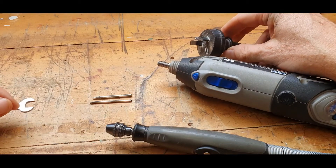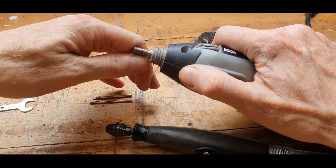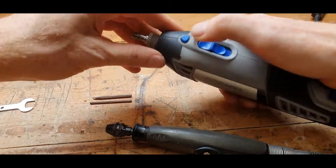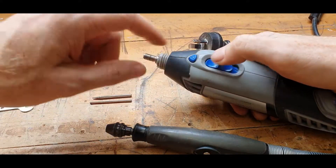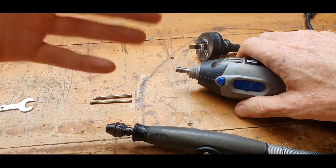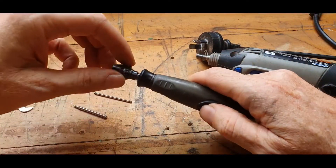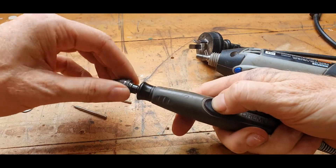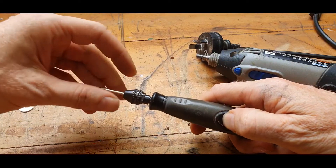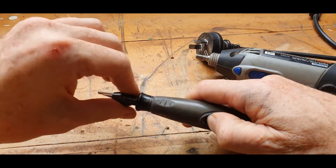Here's the plug — it's good practice. Whenever you're dealing with the spinny parts of the Dremel, you want to unplug it, because if you accidentally turn that on and your fingers are there, I don't want to say what's going to happen. So back to this: you put it on, press the brake, then you can put the bit in and just tighten it with your fingers.